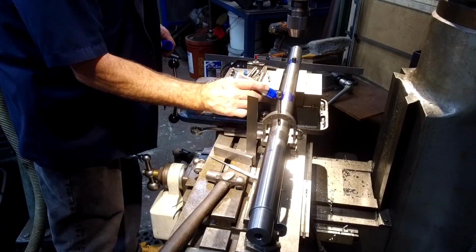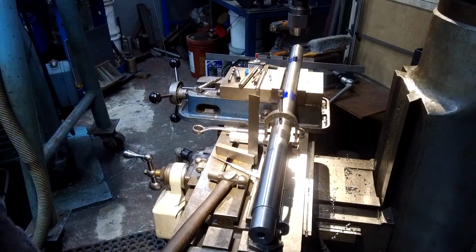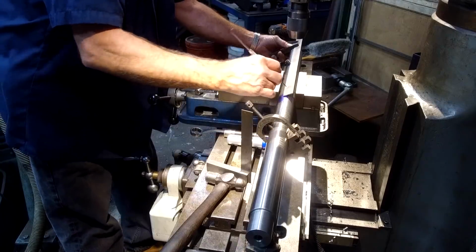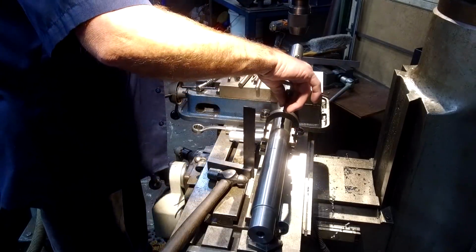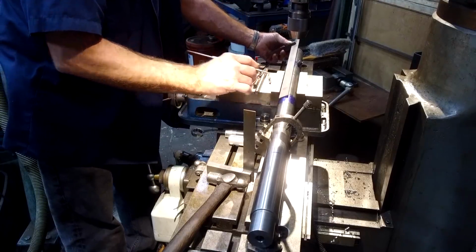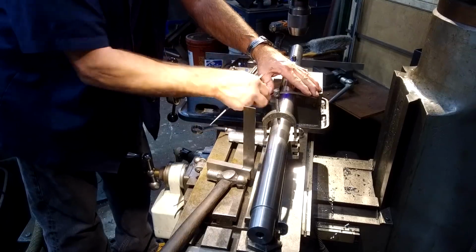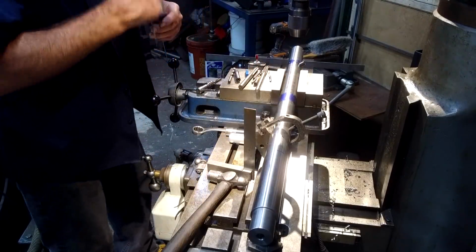Okay, first we're going to finish sharpening up the surface here. We like the big sharpies. Alright, and we'll add a little air. Quick dry, we don't have to wait around. We're going to angle this a little bit this way because we're going to be bringing our scale in from the end, and we have a set measurement that gives us the distance in from the end we want. Then we're going to rotate it to the other side of that square holder there. Alright, we have a pretty good line there, and we can take our flex scale and lay it on there and just fill in the missing line right here. Alright, there we go.